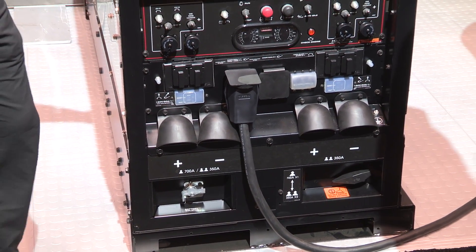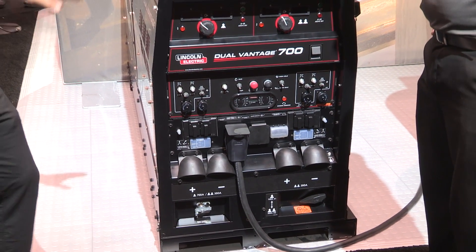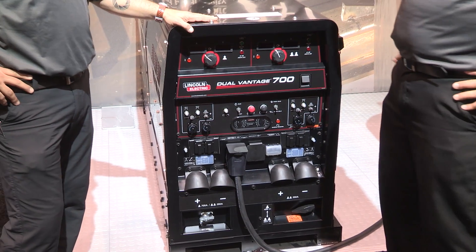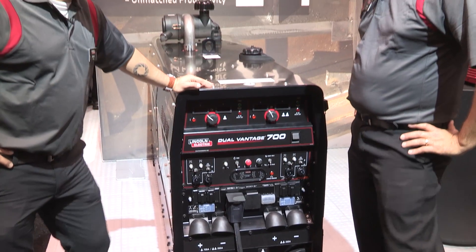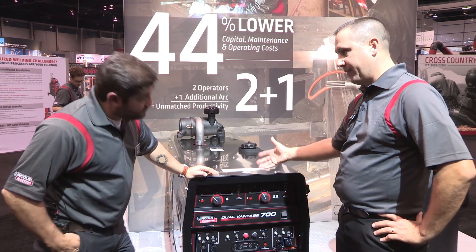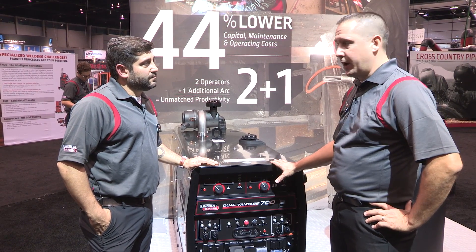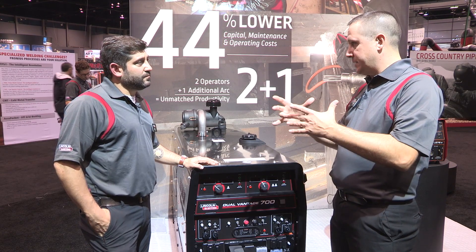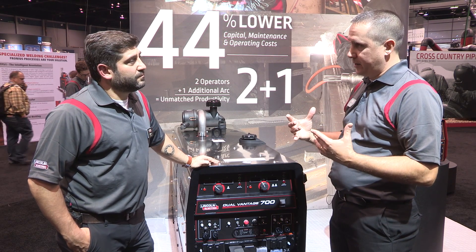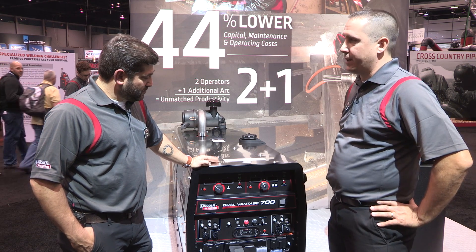Is this gasoline or diesel? This is powered by a 69 horsepower Cummins turbo diesel. Where is something like this used? General fabrication — somebody that wants to service one engine as opposed to servicing three while having three welders off of it. Heavy-duty sub-arc processes where big oil tanks are being welded together with a sub-arc process up to 650 amps — this machine is adequate for that application.